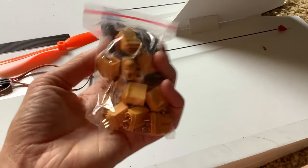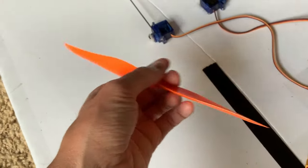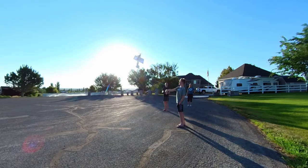For electronics, I found having a motor and an ESC with connectors instead of soldering has been extremely useful. There's actually a cheap pack on Amazon that has an ESC, but unfortunately the ESC doesn't have the same battery connector as mine, so I got spare XT60 connectors and replaced the ESC battery connector. The kit also has a motor, a couple of servos, and even a couple of propellers, but I'd still recommend getting others since I found they broke quite easily — even on my first flight, granted they did go straight into concrete.